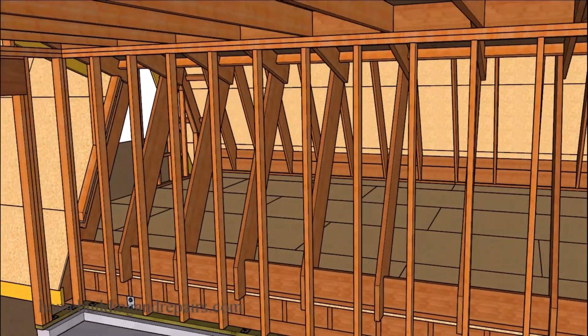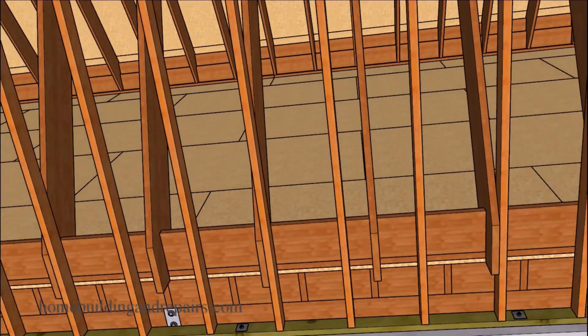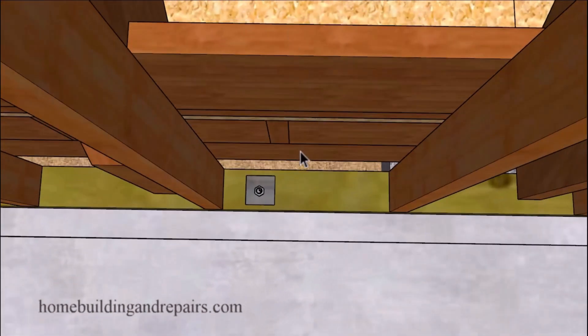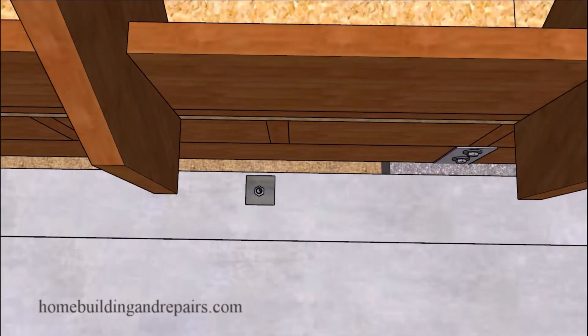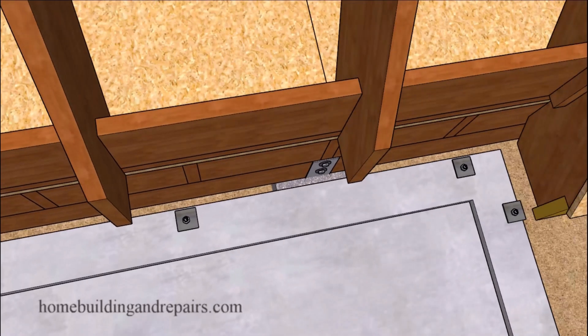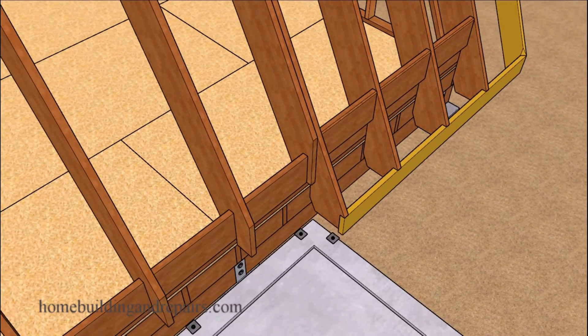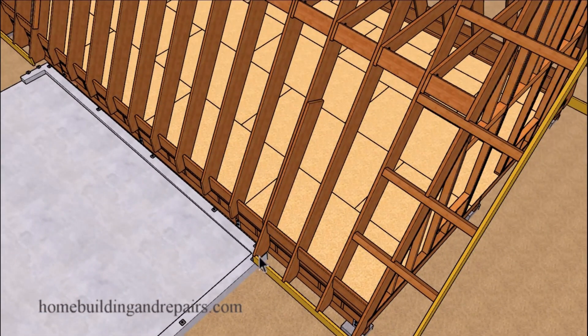We're taking a quick tour of the building. I like to show you what it's going to look like and then tear it apart and show you how it might be assembled. We are going to move the garage an inch and a half away from the A-frame building — that had to do with my original blocking, which I'll go over in a future video. I had to add another section of rafter so we could have some backing for the sheathing and fascia board. You can see where the rafters on this side are cut differently than the ones between the garage and the building.